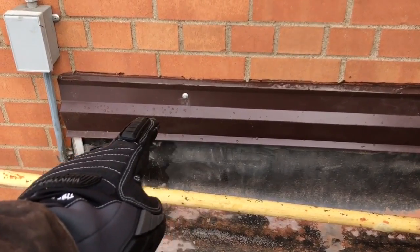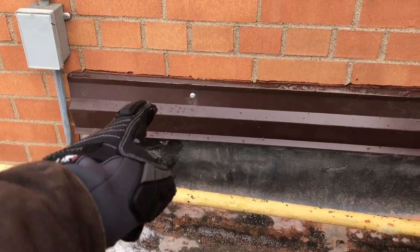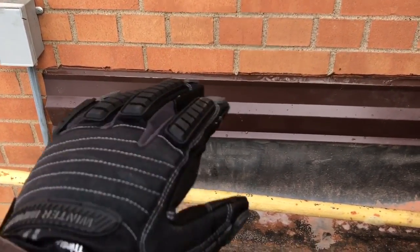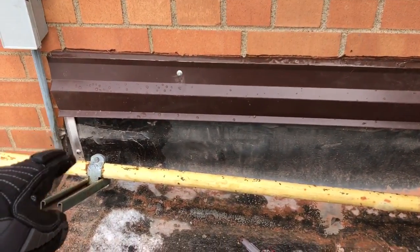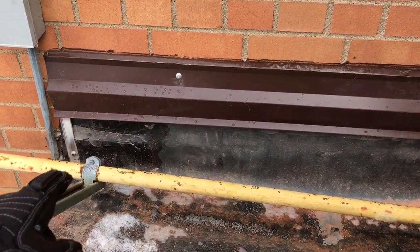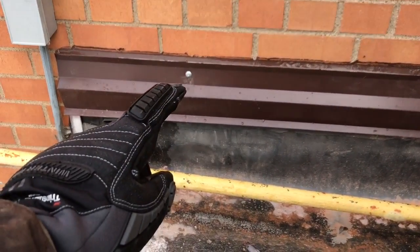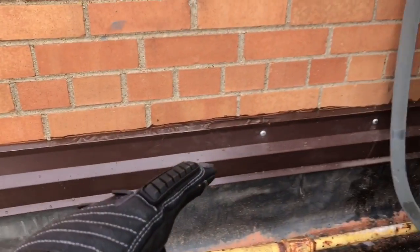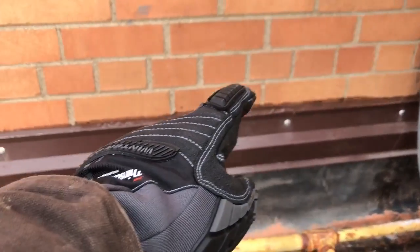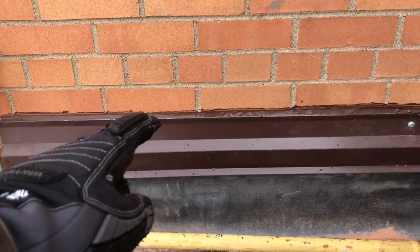Here we terminate the wall. As you can see, the rubber goes up on the edge all the way up to this middle part and it's glued there. On the left side we have this metal T-bar and it goes all the way across the top — that holds the rubber tight to the brick wall. Then over that we put the metal stripping, as you can see, and we drill holes with a hammer drill and put pin nails in everywhere. You can see them here — hammer those in, it holds the metal on, and then on top we put that colored caulk.